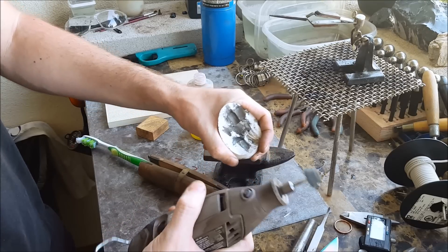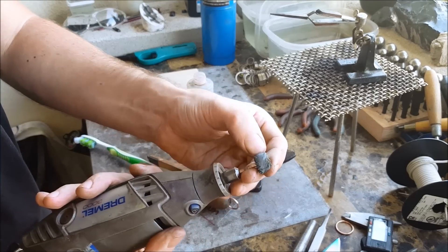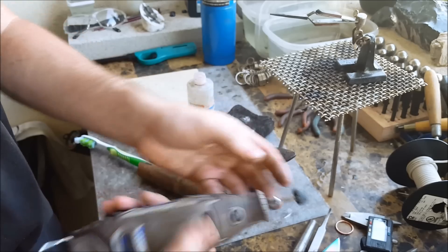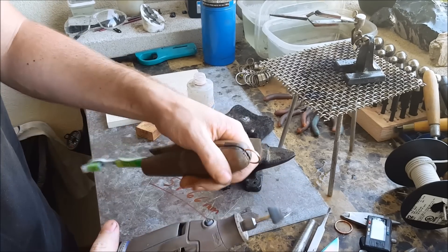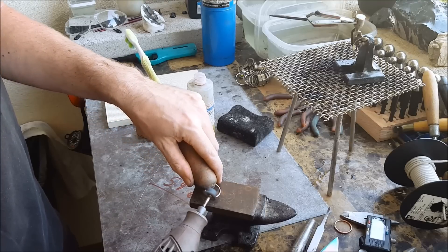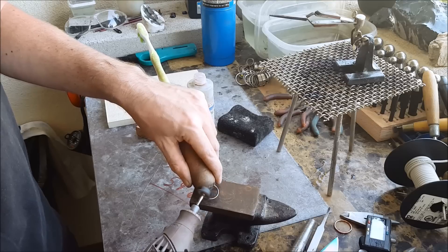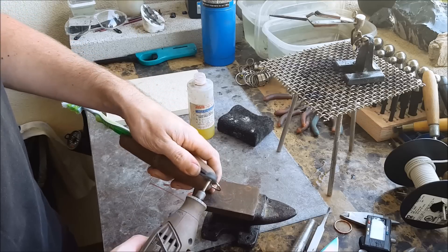Just kind of load it up — it has to get hot and melt onto it. Once it does it'll have a thick layer like this; you can even see my thumbnail in it. Steady yourself and get ready for a lot of buffing. You don't want to press too hard or it will rip the tool out of your hand.